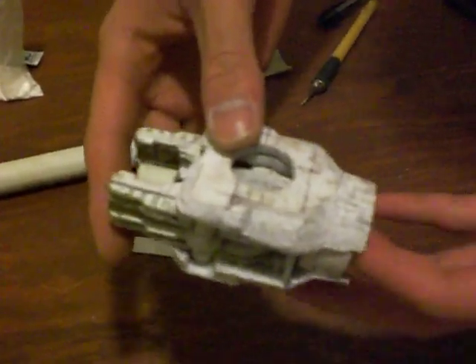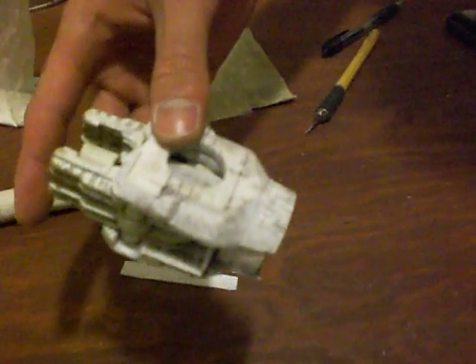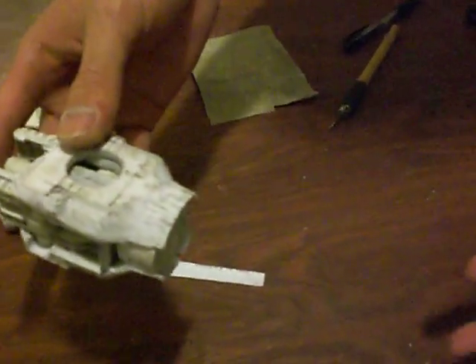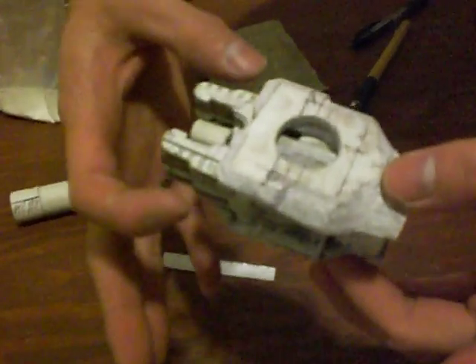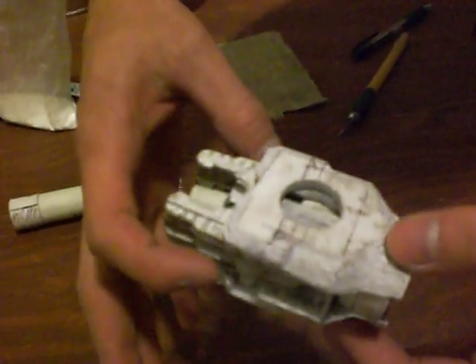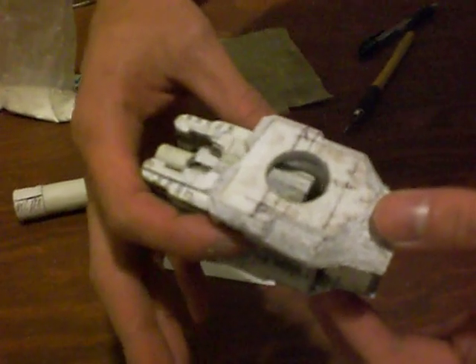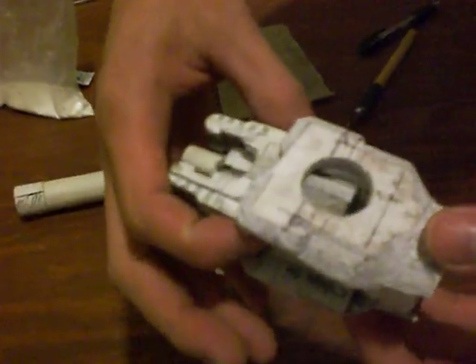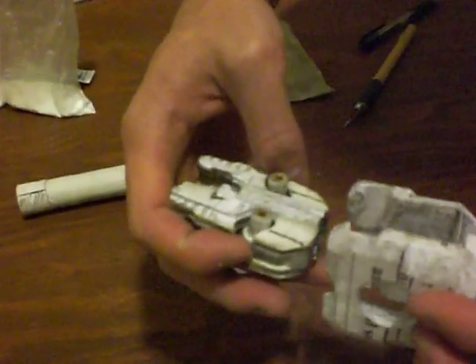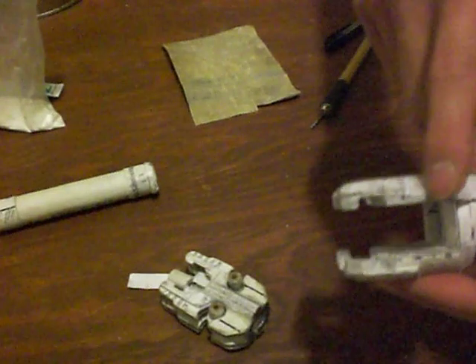When the round is fired, the bullet leaves the barrel and gas builds up inside the booster in front of the barrel, which pushes the entire barrel backwards about eight millimeters. There are unlocking rails right behind the bolt or the rollers, so the movement of the barrel causes the rollers to unlock, and the reaction force of the cartridge kicks the entire bolt backwards to cycle the next round.